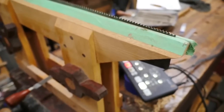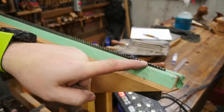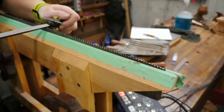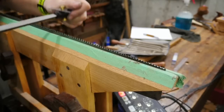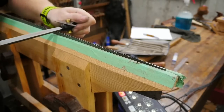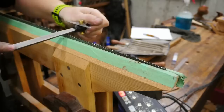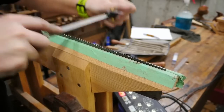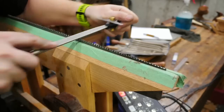And then as I get close to the end, this one, they had sharpened the main saw is at like 5 ppi, and this is up at like 7 ppi, so I have smaller teeth up here. Uh-oh, I lost track of where it's at. There we are. When saws really get dull, they become very easy to see where you were last at, because you have these shiny spots and not shiny spots. So this is a live speed for a touch-up sharpening.